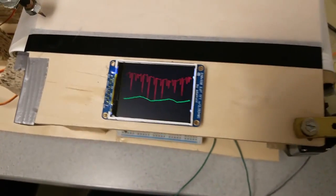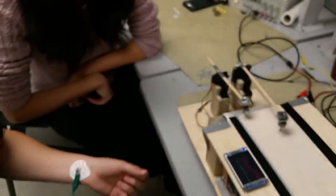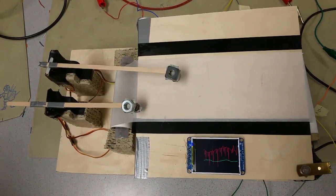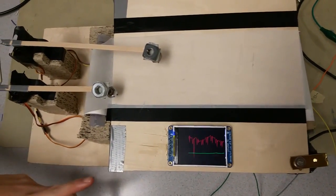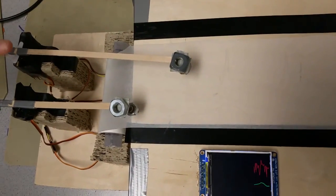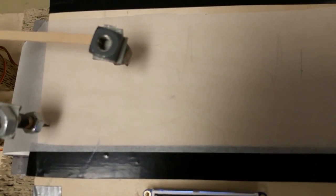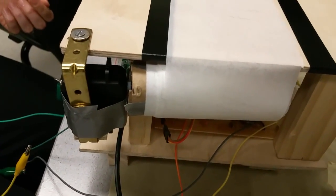So you're going from the polygraph amplifiers through the PIC32 up to the TFT. But there's more — we have a mechanical component as part of this as well. In actual polygraph machines back in the old days, they had little needles with ink to print out results. We constructed something similar with a couple of servos. Each servo is connected in a circuit underneath and takes the output of the EKG and the breathing rate, translating that into movement of these rods connected to a piece of graphite, drawing out the same waveforms on paper. On the other side, another servo is pulling the paper along for translation.